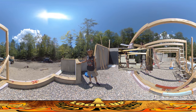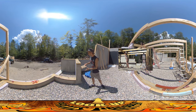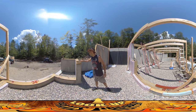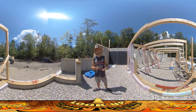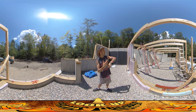Here's an example right here of the sill plate. These sill plates up on the back are a lot like this — they're not totally flat. There's almost a quarter inch of cup right there. The sun comes out, heats things up, they expand; there was rain the other day so the bottom side is wet and the top side is dry, so the bottom side has expanded out with all that moisture, causing bowing. It's a challenge working between the theoretical — a flat board with another flat board on top — versus the real world where that board is cupped. We've had to nail in one side and then pull it down flat, using ratchet straps — you can see some hanging down over here — to twist things into straight before nailing them in.